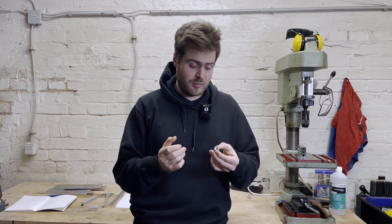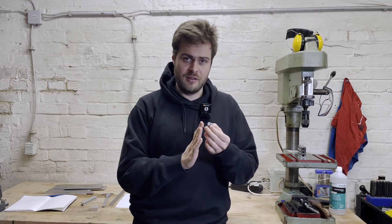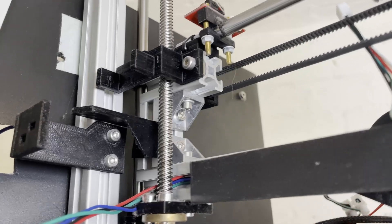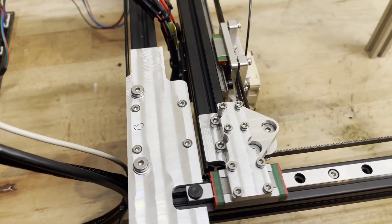The parts that I need are brackets that hold together aluminum extrusion pieces. Usually in my builds I use these right angle cast pieces, but since I'm machining all of the parts for the 3D printer they don't really fit aesthetically and they do lack some functionality. Due to the way they're manufactured, they're only precise in the 90 degree corner and they leave quite a bit of play in the other axes. Tightening them can be difficult as the corners can be cramped.